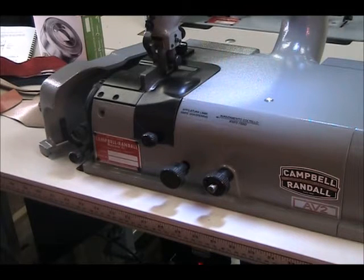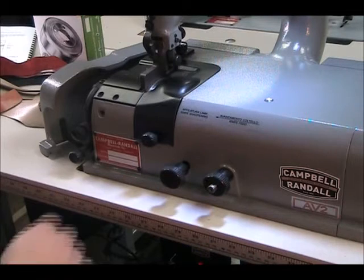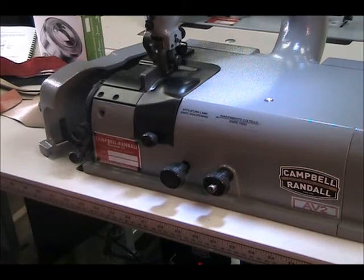And so this is for a first time grind. It could take a few minutes. A brand new blade, it's not unreal to spend 20-30 minutes grinding the blade out. So when you're just starting out and you're going to start the day, give it a minute or so on the grind, and then throughout the day periodically grind it out as you start seeing it get dull.